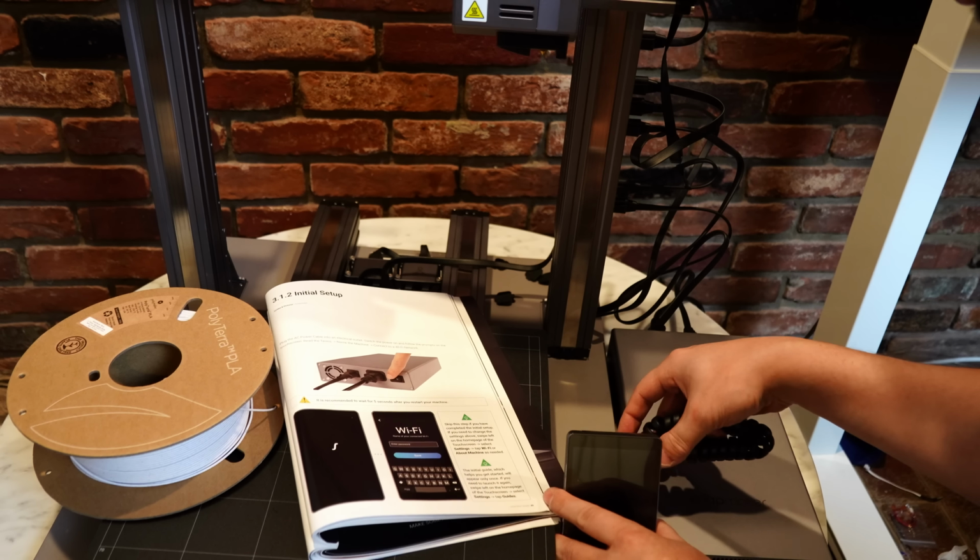However, the absolute speed is a little bit lower. This one printed in, I think, 40 minutes on the Ender 5 S1 using Klipper. This one printed in 58 minutes total print time. I think that includes some of the waiting time for letting this bed heat up, but overall, pretty good result. You can see the bow of the Benchy is a little bit warped. That indicates that there's insufficient part cooling on this machine for printing at these speeds.